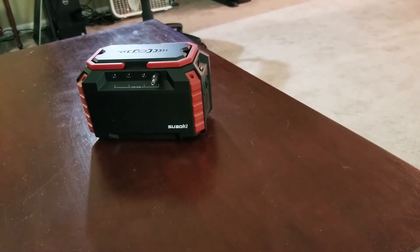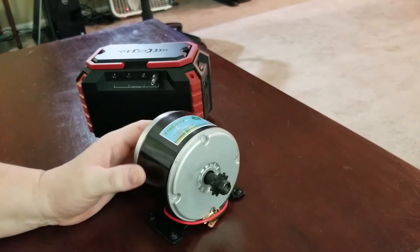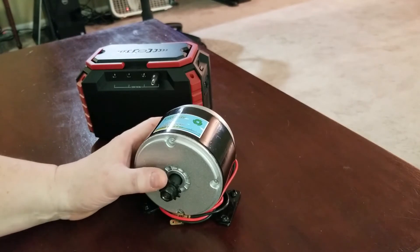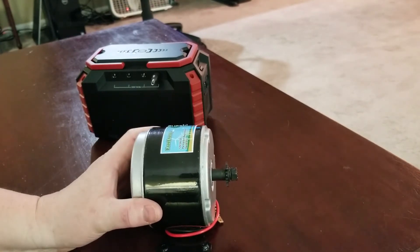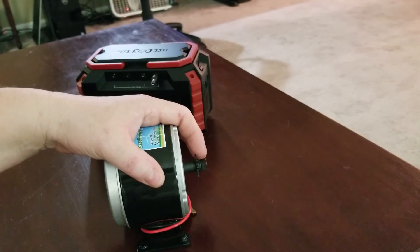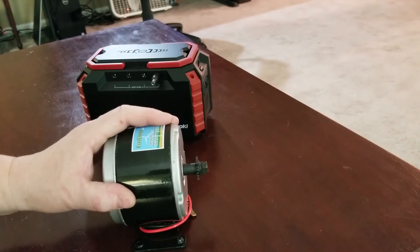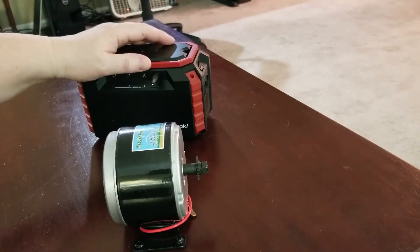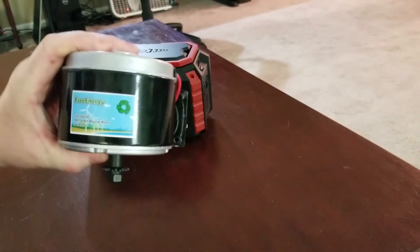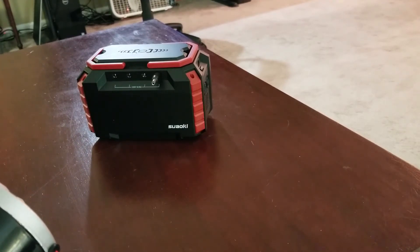Downstairs I tore apart a treadmill — I have a treadmill motor plugged into a charge controller to a 12-volt battery, so with that device I could charge this. These are little wind generators. You could hook this up to a bicycle — just hook a pulley up here, take the tire off the rim of the bicycle, and run a belt between the bicycle and this device to spin it. You'd hook this up to a charge controller to a 12-volt battery and charge this directly off that battery, as well as many other devices. These are very nice units for a DIY hookup to a bicycle or a piece of exercise equipment.